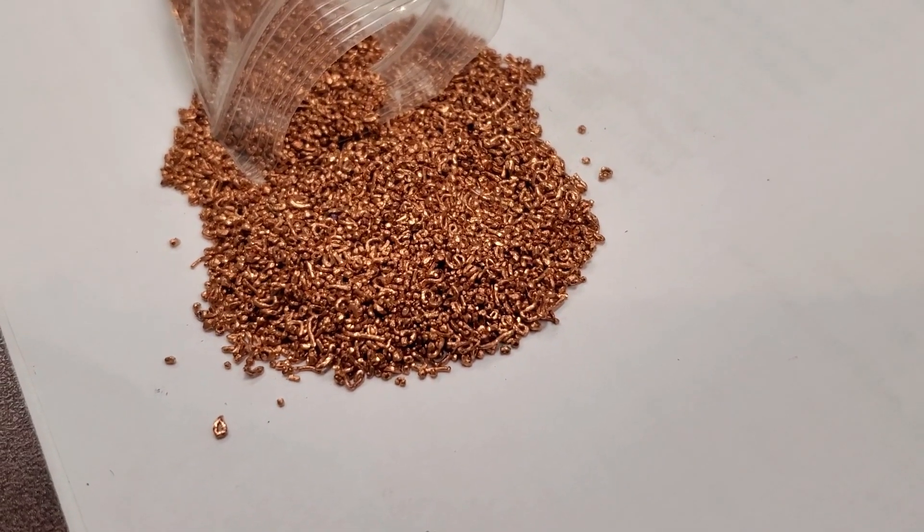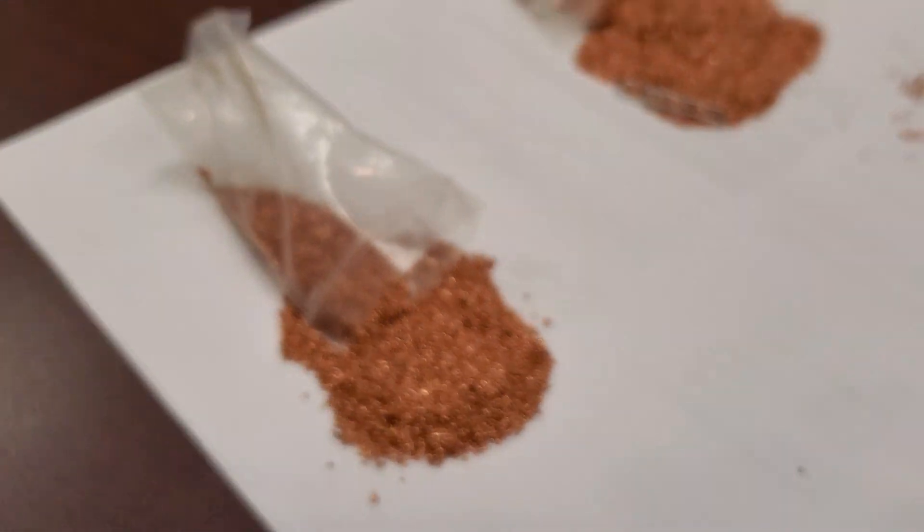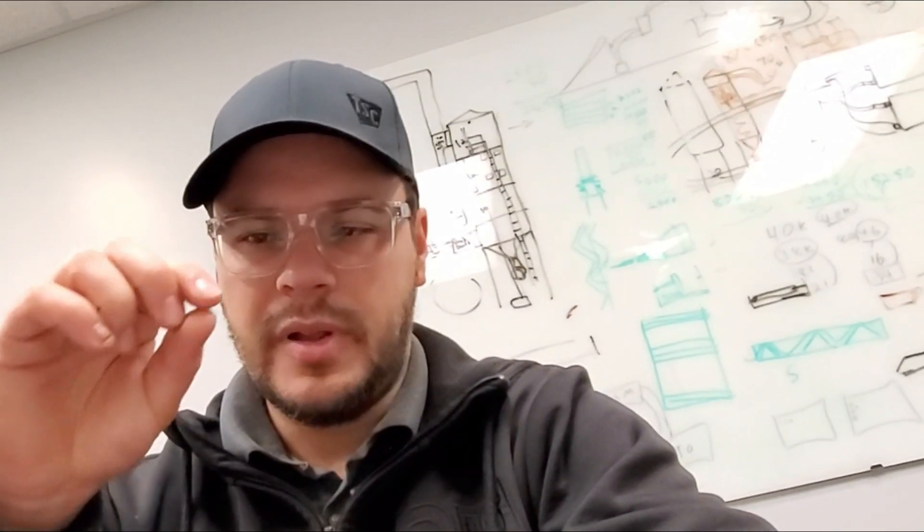With THHN insulated stranded wire, the turbo mill will take those strands and roll them into a ball, densifying them so you're not losing material on the air side. When material comes onto your air table, if you have a really light, stringy copper fraction it tends to sit on the bed of air and can float back. By running it through the turbo mill, you densify it into a little ball — it sinks to the bottom and climbs right up the top of the air table. That's the benefit of a turbo mill. Like, comment, subscribe, and reach out if you have any questions.